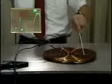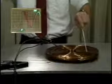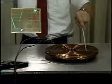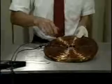Let's see if we can estimate how high the pancake coil will rise for a given coil current. We are limited in height by the maximum current before we blow a fuse. Focusing attention on a single turn of the circular coil with radius A, with A much larger than the wire diameter, we can approximately use our inductance formula for a straight wire of length L, taking L to be the coil circumference 2 pi A.